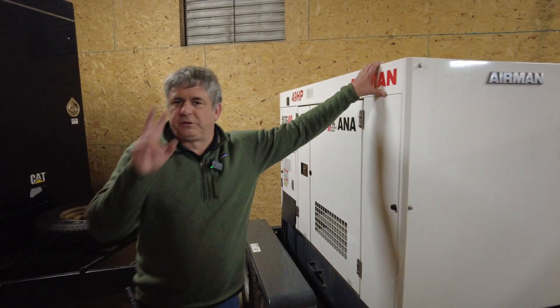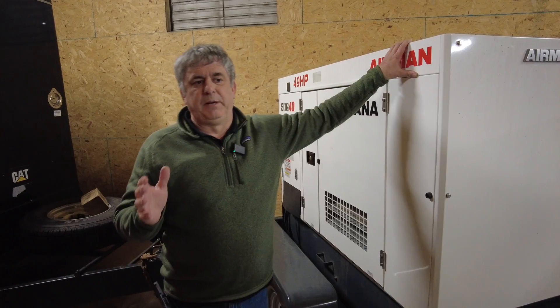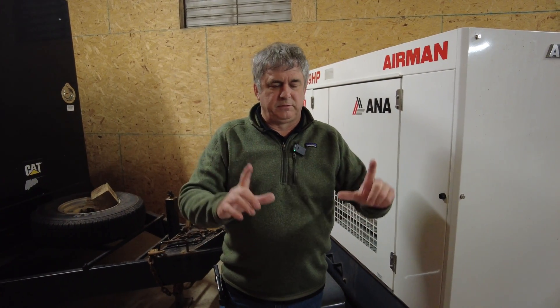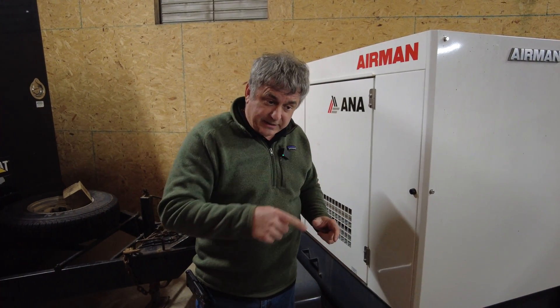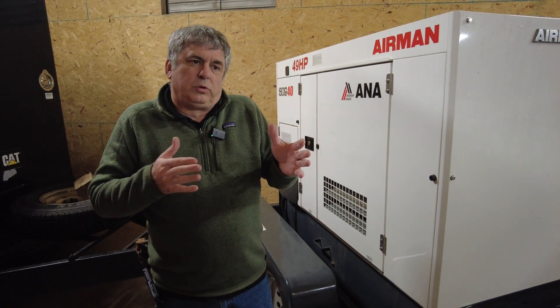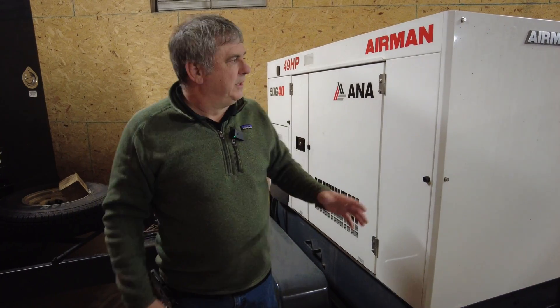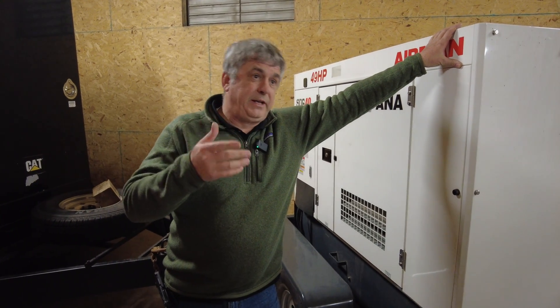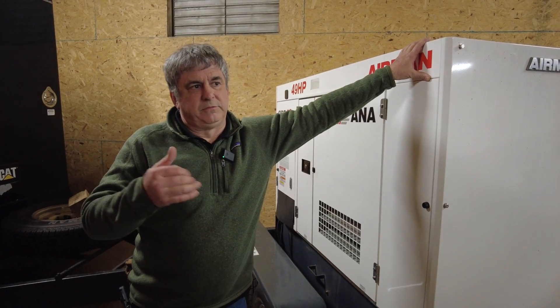In the world of electricity, there are two kinds of loads: inductive loads and resistive loads. Resistive loads are created by resistance — the best example is those little heaters you plug in the wall, or the coils inside your hairdryer. That's a resistive load. The fan that blows the air across those coils is an inductive load, made by creating a magnetic field and spinning. Resistive loads work out so that a 125kW generator at a power factor of one-to-one is the same as 125kVA — which is what the load bank is.